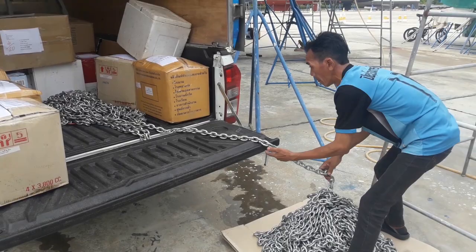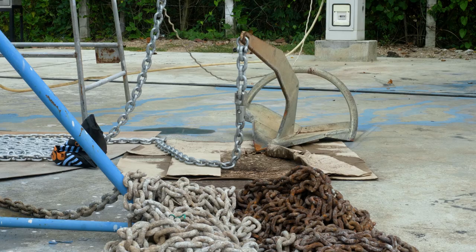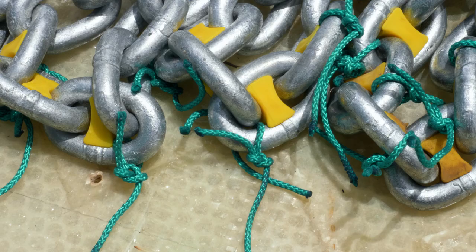We took delivery of a new chain as well — I was absolutely delighted because I got so fed up with that rusty old chain. I think we could have got another couple of seasons out of it, but we'd already galvanised it once and you can only really galvanise a chain twice in its life. We figured we're in the right place to get a new chain. We saved 20 metres of our old chain, so effectively we have 120 metres of chain, which should be just enough to see us clear of places like the Aleutian Islands where there are some pretty deep anchorages.